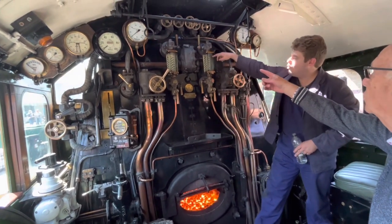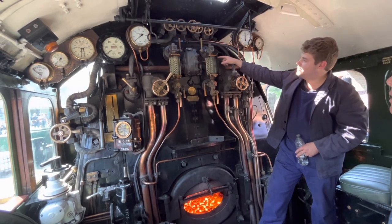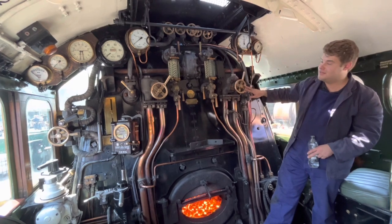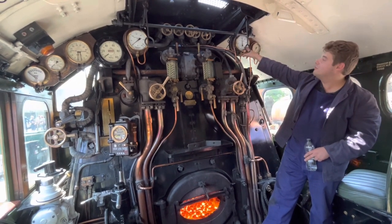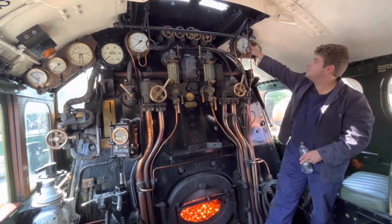Water level — is it? Yeah, water level in the boiler. I just topped it up before you guys got on — that's what that churning noise was. It's just up in the top there, bobbing in and out. You've got two feeds that put water in, and then you've got the pressure gauge. It's nearly 160 pounds in it, and it's going out tonight, so I'm slowly bringing it round to get ready, up to about 220 pounds.